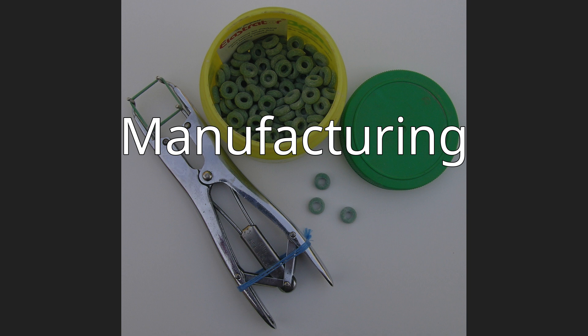However, in 1969, the world's first continuous cure extrusion line for rubber bands was installed at the Alliance Rubber Company manufacturing facility. Rubber bands produced using this high-speed continuous production equipment feature an improved modulus stretch, a smoother, more consistent quality, and yield a higher count per pound. There is no need to use mandrels in this process. With the continuous cure process, the rubber is forced through the aperture or die, traveling in a continuous stream directly into and through a curing tunnel, which uniformly raises the extrudate to the vulcanizing temperature and maintains it there for the entire curing or vulcanizing period. This is most commonly referred to as an online rubber extrusion process.